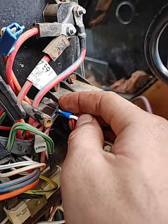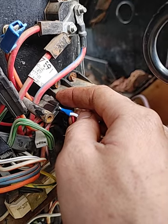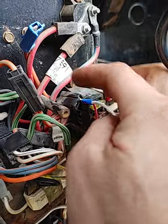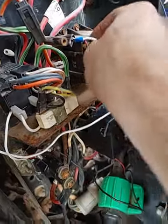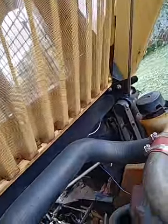The white wire is power going to the switch. This little spade connector — that pin right there is the only one I've found to get 12 volts from without the switch. 12 volts when the key's on, 12 volts comes to this. It's the only one I've been able to find without having to cut a wire somewhere else.